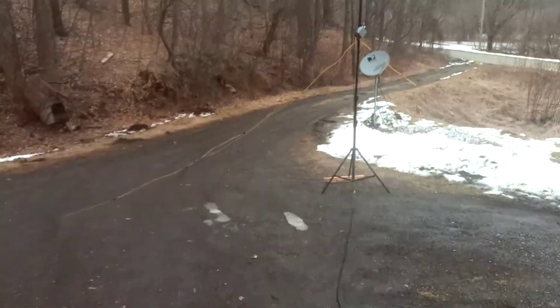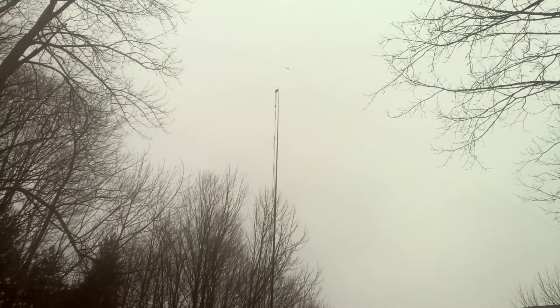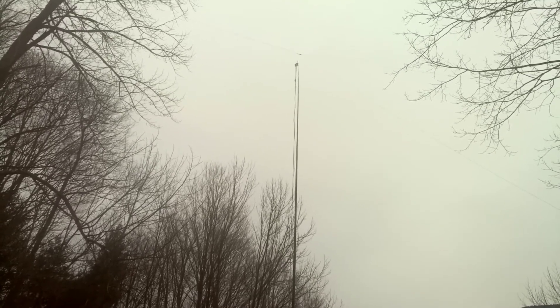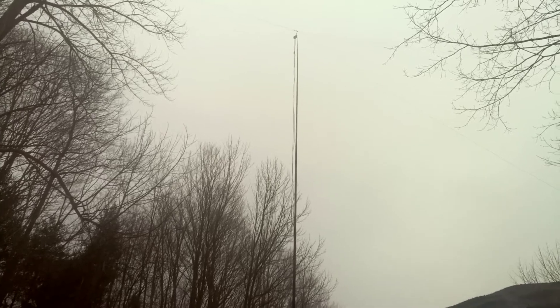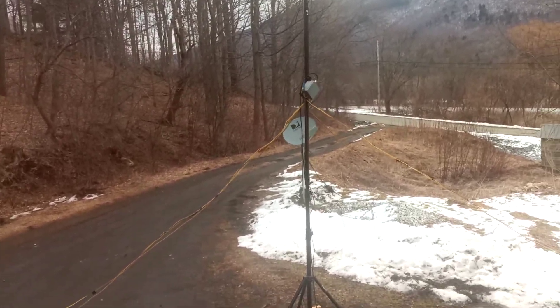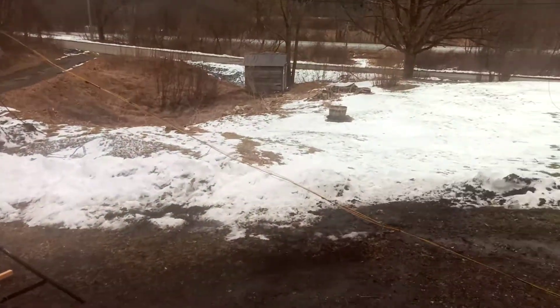It's all built into a rigid case. I've got it sitting on a ladder in the garage. I freaking love it. So I'll show you the antenna — this is my portable quarter-wave ground plane. At the top is a pulley — it's a lightweight plastic pulley, piece of cord goes up and around the pulley and comes back down. That allows me to swap elements for 20, 17, 15, 12, and 10 meters.